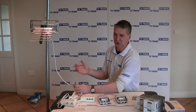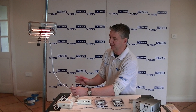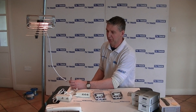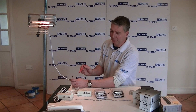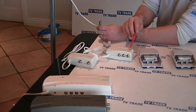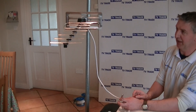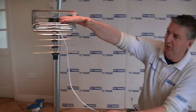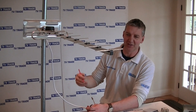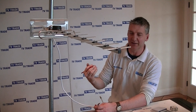In certain cases, due to obstructions or because of your particular location, you'll find that you'll need to boost your signal to get good UHF signal to feed the TVs in your house — this is where mast amplifiers come in. Mast amplifiers are always used in conjunction with power units. You have a power unit plugged in somewhere in the house and it sends out a 12-volt DC signal through the cable to a mast amplifier which sits about a meter underneath the UHF aerial. A distribution amplifier takes the existing signal and tries to boost it, whereas mast amplifiers are actually trying to pull in additional signal, and from that perspective technically it's a better solution.